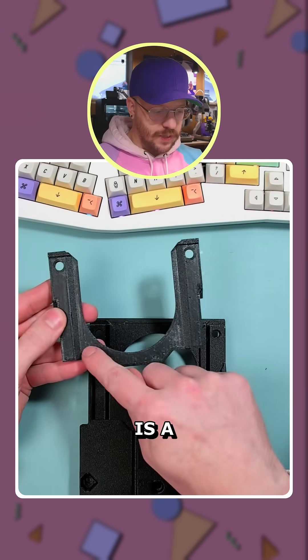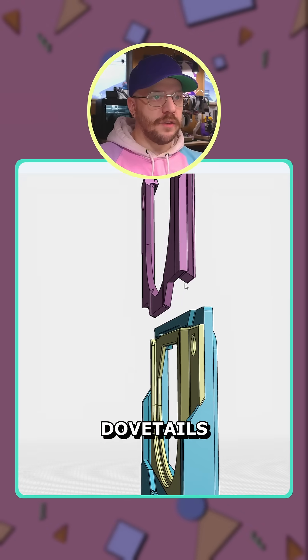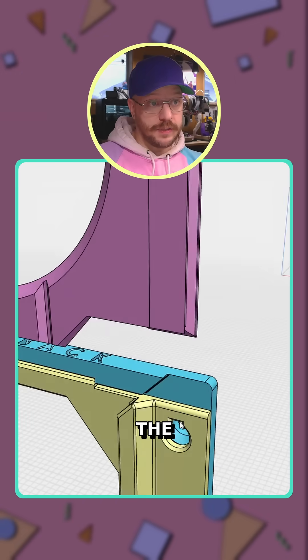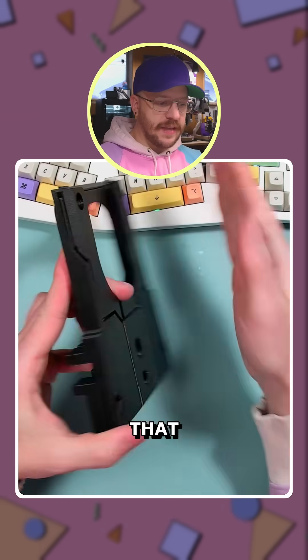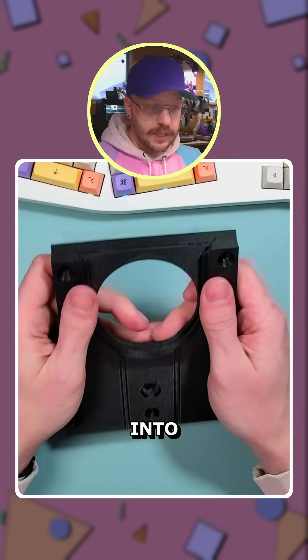On the back side of this faceplate there's a subtraction of that dovetail so it can slide into those channels. The bottom of the support plate has dovetails so it can lock into place on this face. These channels have basically the same dovetail angle, so it slides into place and those channels on the side are creating tension. When the second insert reaches that same depth, those little lips at the top snap into place as well.